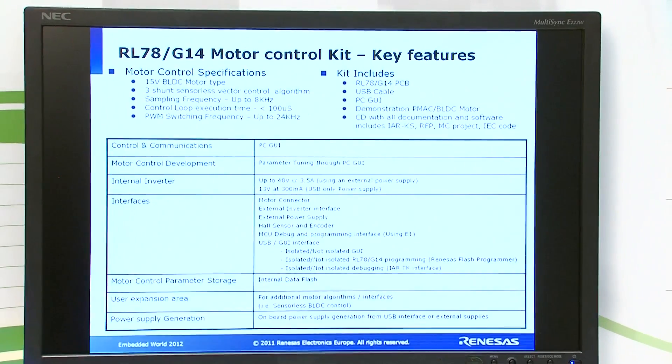Because of the integration levels, the RL78, like many of the other families, integrates a lot of external functionality, such as a voltage regulator. External EEPROM can be incorporated on chip, along with external references for the A2D and also for clock monitoring.